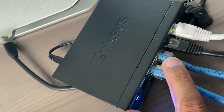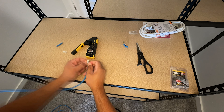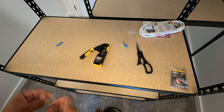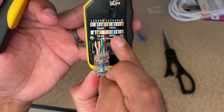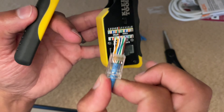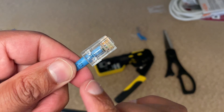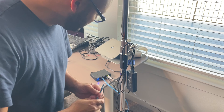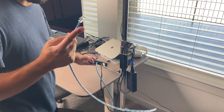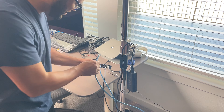So I redid one end and this cable wasn't even getting any signal before, and now we have an orange light — that's super promising. Let's go over and do the other side and hopefully we can get this to turn green. Looking at the bottom: brown, brown striped, green, blue striped, blue, green striped, orange, orange striped. I'm going to stick it in here and crimp. Here's the finished product — plug it in. So here's the moment of truth. This is the one I just crimped, I have the other side crimped too, and when I plug this in it should hopefully turn green. If it turns green, we have a good signal.